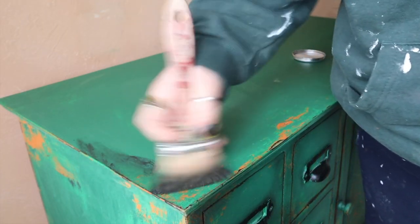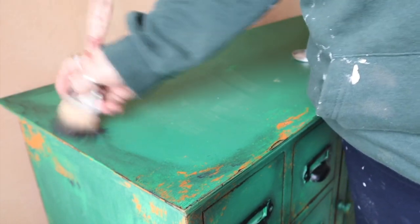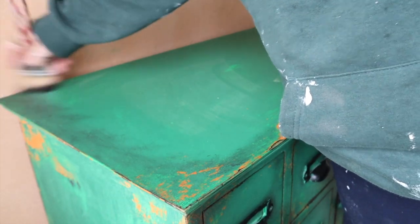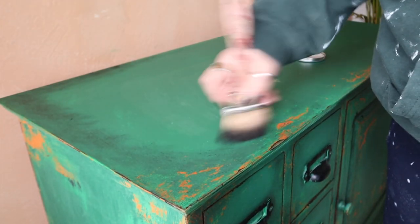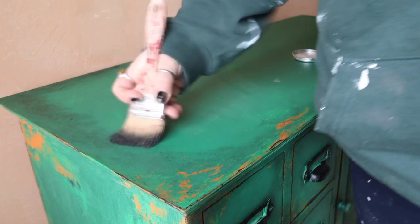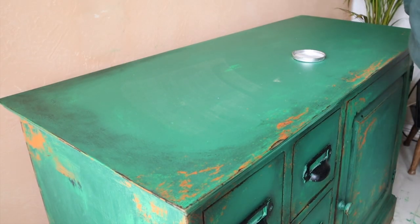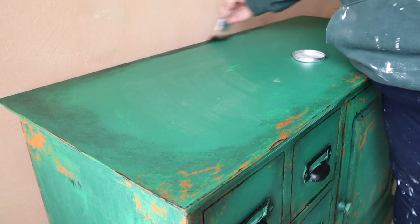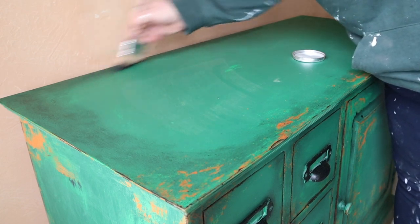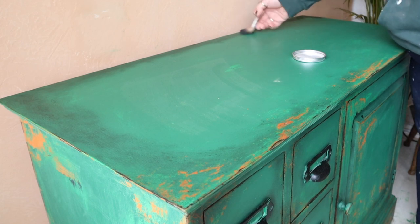I did two coats of the clear coat and let that dry before adding a little bit of black wax to make sure the top matches the rest of the piece. I'm concentrating it around the very edges, using a swirl motion with the same brush to get the black wax around the edges and then fading it out toward the center. Obviously we don't have clear wax down on here, so I'm relying on the clear coat underneath to act as a barrier — it kind of does the same job. I'm slightly feathering the black wax so it fades away to the center.